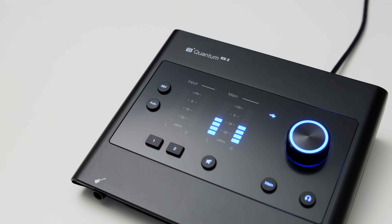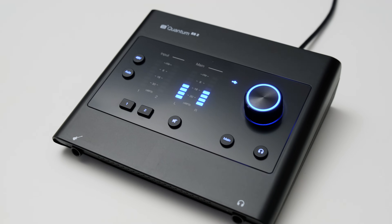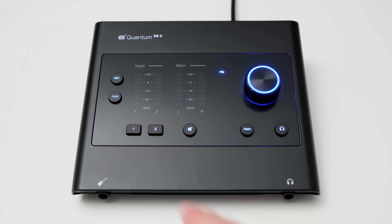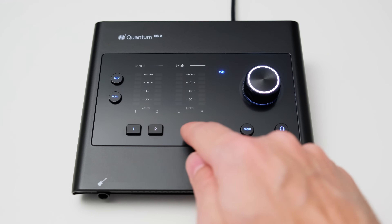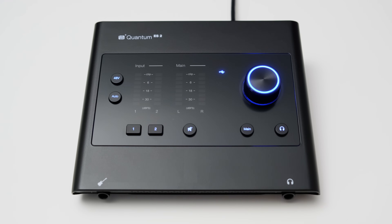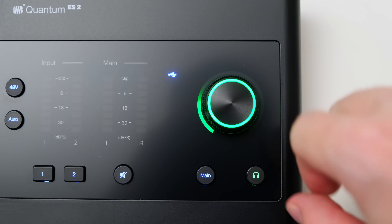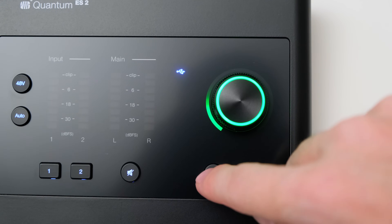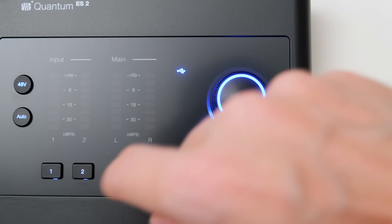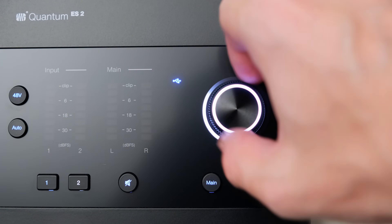Full disclosure, I have bought the interface with my own money. Let's jump right in. The ES2 has all controls on the top, which gives you ample space to use all the controls. Starting on the left you get a phantom power button which lets you toggle 48 volts for each of the two inputs individually. There's also an auto gain feature which can help you set your gain to a proper value. With the selection button you can select a channel, and then the mute button mutes all the outputs. There are two more buttons which let you select the main rear outputs and the headphone outputs, and with the knob you can control the aforementioned outputs. So gain setting and volume are all controlled with this one encoder. Around the encoder you can always see the current setting, which makes it really easy to see what you're doing.